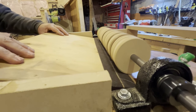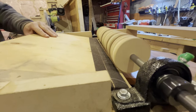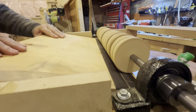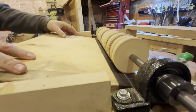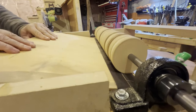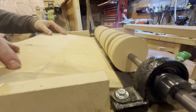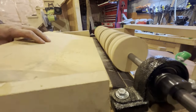Okay, I wanna sand off the rough edges and make this a perfect 3 inches. So what I did was I put down a nice smooth board first, guaranteed to be flat, and then I put some 90 grit or 80 grit onto the piece of MDF on top. Now I'm just gonna slowly keep raising up and sanding until I get these things perfectly smooth at 3 inches. And after this, I'm gonna go to a smaller grit.